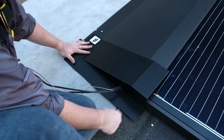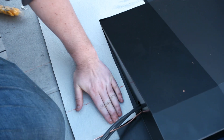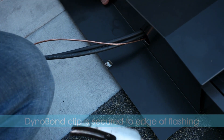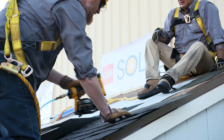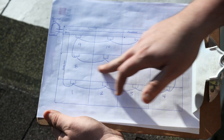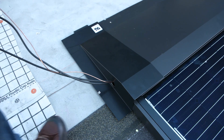The corner flashing interlocks with the top flashing. To transition into the shingling, cut an L-shaped piece of Stormguard and place it over the corners, then add Stormguard followed by Quickstart, and you can do your shingling. Important rule: there needs to be at least one row of shingles before you hit the ridge. We followed the wire diagram, and now all three wires are pulled up toward the junction box, ready for the electrician. If you and your crews are just starting off with GAF Solar Energy Systems, make sure you read our instructions and watch our videos. Thanks for watching.